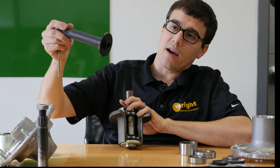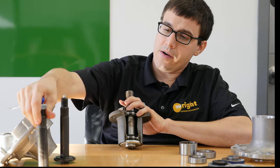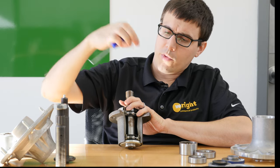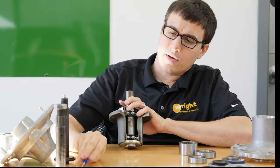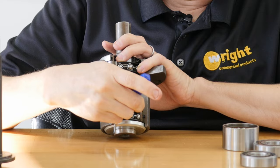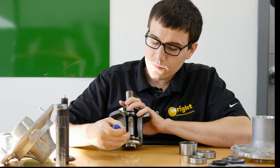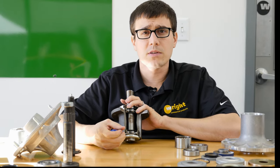You can see this has something similar on a John Deere. Although when you have a square shoulder, sometimes stuff will still climb and jump in there. It's important to have a little notch there where it can't climb into. So keeping things from getting wrapped around the spindle is really important.